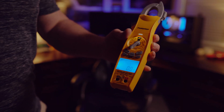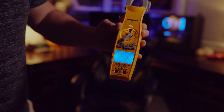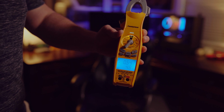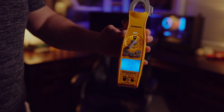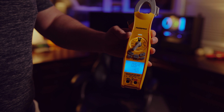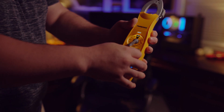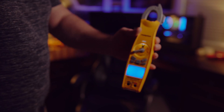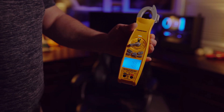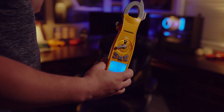With nothing connected to or going through the amp clamps, we're reading a half an amp with wireless on. I've seen this thing read from half an amp all the way up to maybe two and a half to three amps when the wireless feature is turned on — and that's tacked on to the true reading. I've verified that with a couple other meters just to make sure, and also verified against a VFD, and this thing was definitely adding it on. The bigger concern is when you've got it on the 600-amp range and you turn the wireless on — I've seen this be all the way up to 13 amps off. That is a drastic difference and something to keep in mind if you're purchasing this for the wireless features of being able to do wireless current readings.